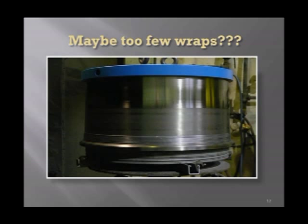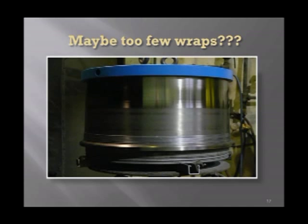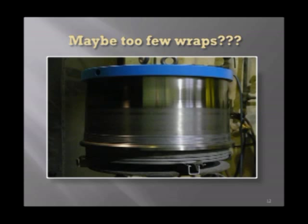Now there's only one good reason to have this few wraps, and that is because it won't run otherwise. Your operators have been pragmatic, saying every time they fill the block up with wraps it overlaps, breaks, tangles, or whatever, and this is the only way they can run. So there's the pragmatic side and then there's the practical side. If you're running your blocks for this reason, you are creating excessive slip and you are wearing out your blocks prematurely, because the blocks are designed to be either two-thirds or three-quarters full on the face to run optimally. That's where you get the friction and the drive to move the wire to the next block with a minimum amount of slip.